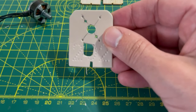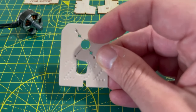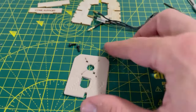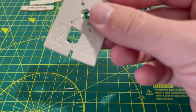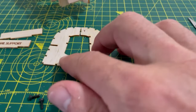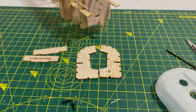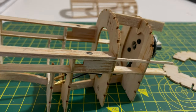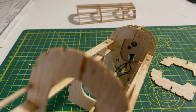For the motor mount I'm just going to use the provided vinyl piece. Where I need to mount the motor I've used the four holes from the Cox motor template, worked out the centre, made a bigger hole that will allow for that screw there, then using the wider space screws drilled two more little holes which I'll bolt it onto. Cut the slot for the wire to go through into the fuselage. The slot at the bottom is so that it slots on - I can then slide into place and glue it. I'll then fit the front former on with the cowl support, and when I put the cowling on along with the aluminium adapter it should all fit nice and neatly. The motor is now mounted securely in place and fixed. The advantage of positioning it here is I can actually reach those bolts that hold the motor on through the battery hatch, should I need to - I can get there with the extended Allen key.